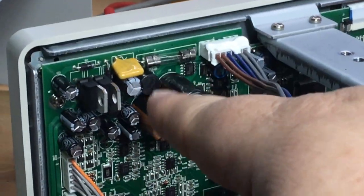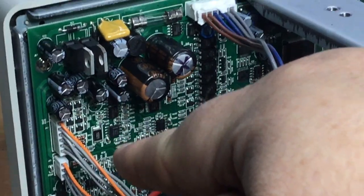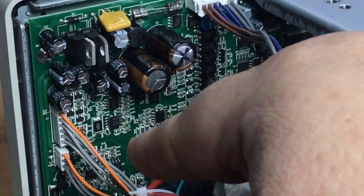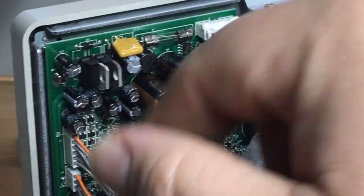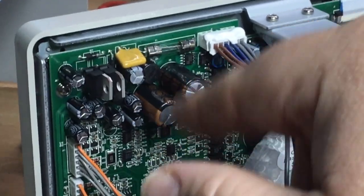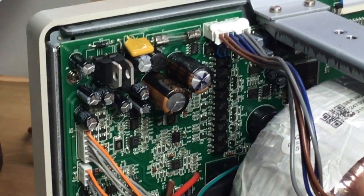And somebody's reported replacing those, and some other capacitor down here somewhere, and one of these TL chips, which apparently started to get hot to the touch. Anyway, I went round, powered it up. I managed to get it going, this power supply, just by switching it off, switching it on a few times. Then it came back up, because there were quite a lot of times it wouldn't even come back up.